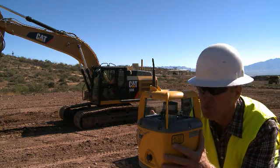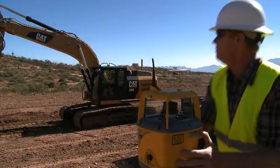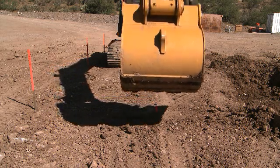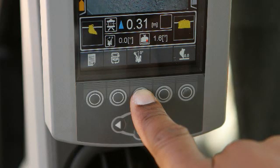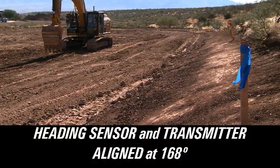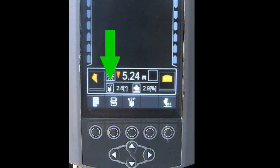Laser transmitter setup and setting depth and slope onboard the machine do not change. Bench the heading sensor on the center line of the slope direction using the benchmark button. If using a laser reference, this center line would be parallel to the laser transmitter direction. As the machine is rotated, the display shows the rotation angle from the benched position.